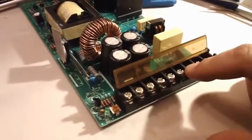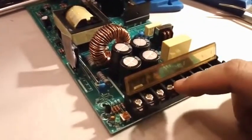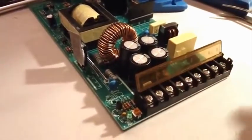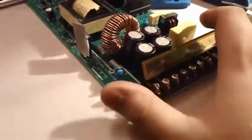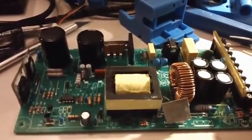You have your main voltages here — live, neutral, ground — and then a set of three positive 24-volt rails and a set of three negative DC common ground rails. It's very similar to the power supply inside my Mendel Max 2 3D printer. It's a 24-volt supply; I don't know if it's the exact same brand. Whenever I get these things, I really enjoy taking them apart just to see how poorly they're made.